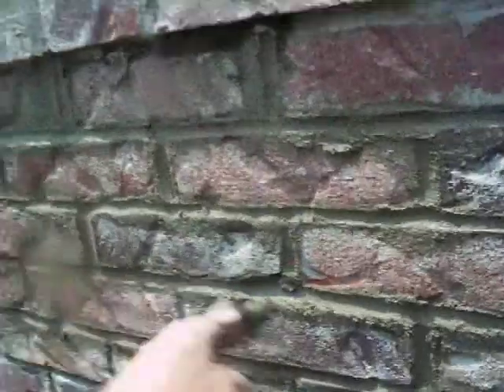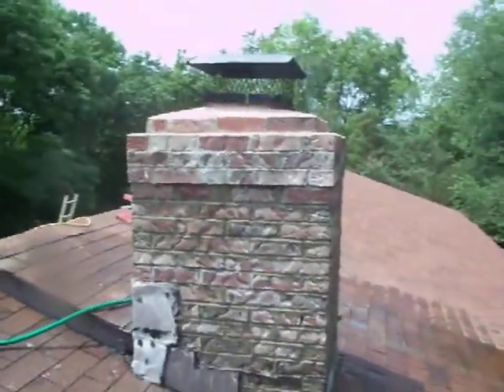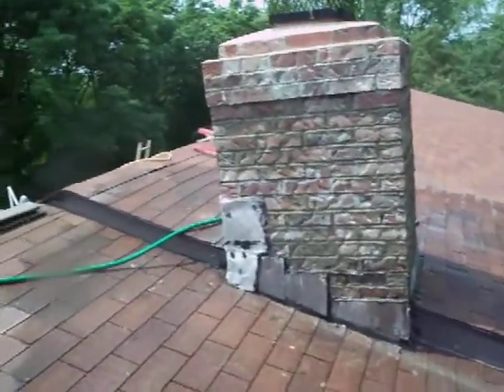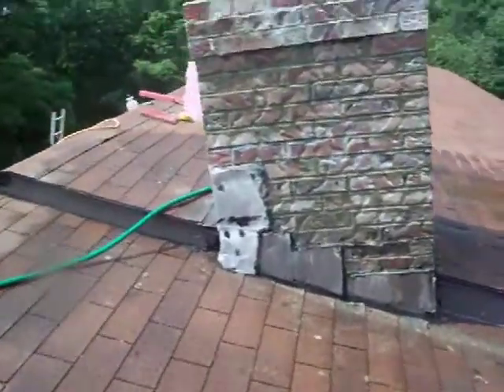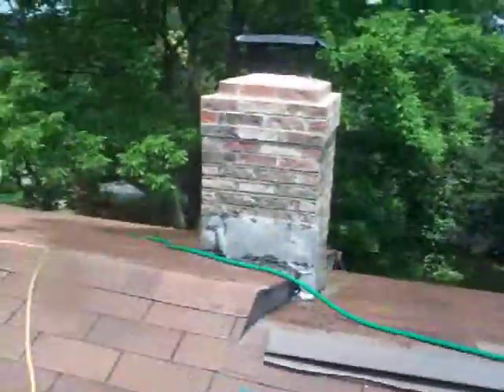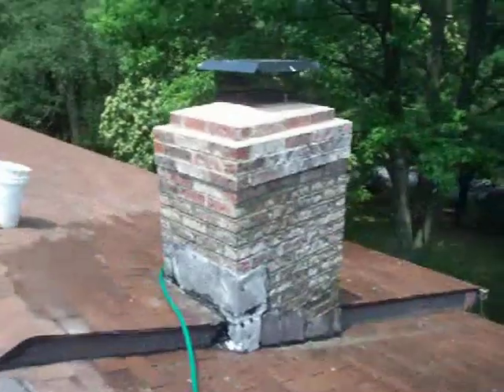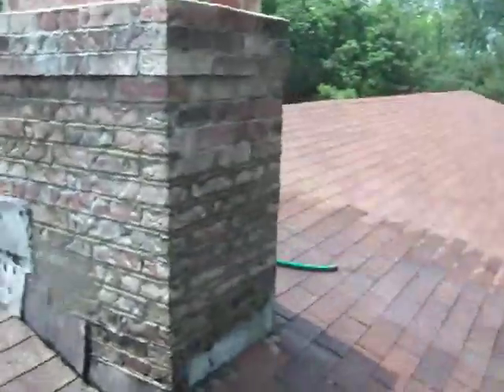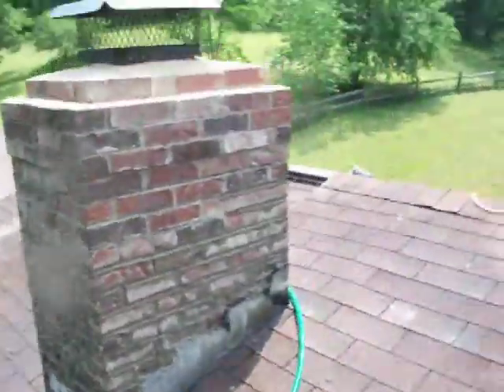I'm rinsing the roof right now. The lady had a lot of water infiltration problems — I couldn't believe how many people looked at it and said they couldn't imagine what the problem was. I'm picking off caulking that thick, just peeling it back and looking at pulverized masonry cement. This side came out nice. Everything sits so much better — it's a good job I've done here.